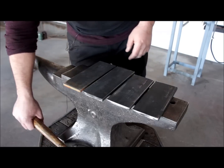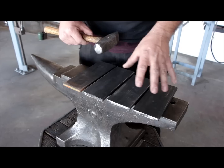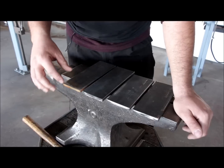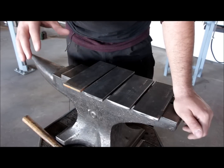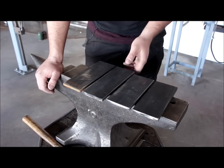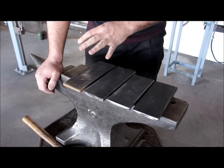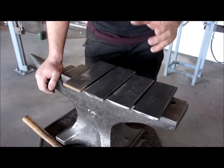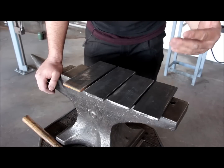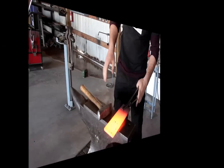I'm going to use a 2-pound hammer with a slightly rounded face and just give it a slight texture. I'm going to texture the surface and the edges, but I'm not going to take the edges off because that wasn't a common thing they did at the time. Art Deco was very famous for textures. They textured most surfaces, but they were not super aggressive textures. They were not rustic with large marks, but mostly just fine textures everywhere.